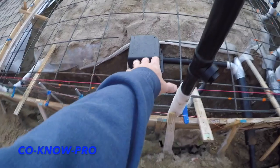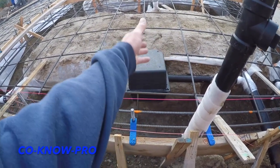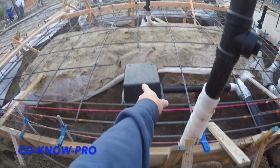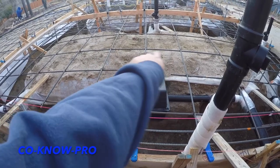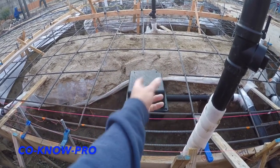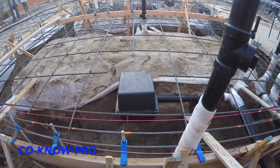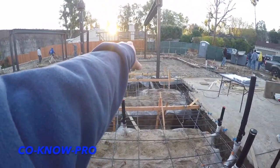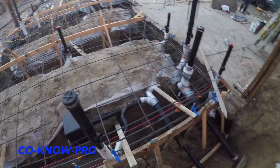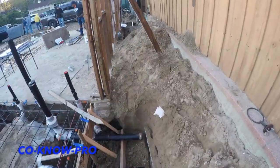See this box right here? This is for our shower — there's going to be a shower right there. Same thing for our bathtub: we have one on the other side. This little box is so the concrete pour will go in there, and then you can break it out when the pour is done and remove that box to have access to the plumbing. There's one over there for the bathtub, and we've got our plumbing sticking out right here that's going to shoot over there.